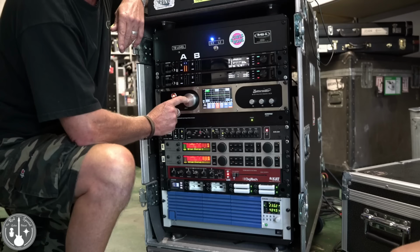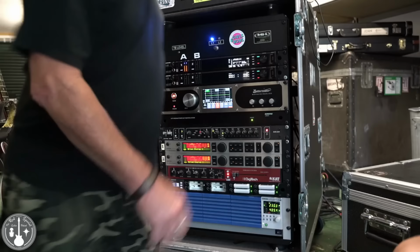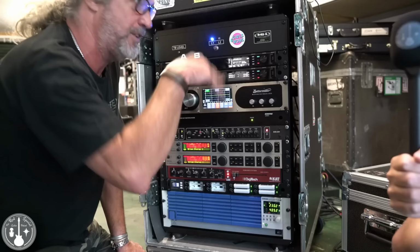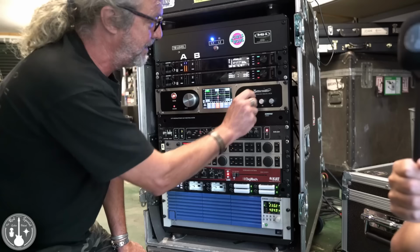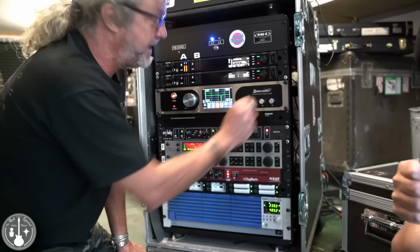Now what this does is it's a four channel parametric EQ. What this means is that if I start getting some spurious noise at a certain frequency up there somewhere, I can find it on here, and I can boost the frequency and move it along within this wave band. I can move it around till it gets really loud, tighten it up like this, and then I can take it out. So this is the theory, because we haven't tried this yet.